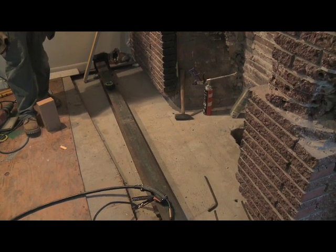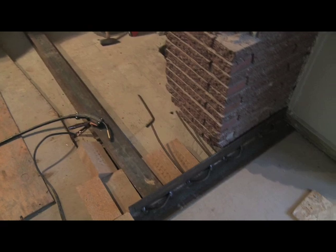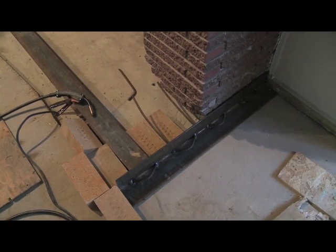And it's important that we have the steel support structure, because we can't have concrete or heavy stone actually bearing on the wood floor elements, because the floor joists weren't designed for that kind of load. And so we're going to reinforce this over the beam. The beam is going to become integral with the slab as a composite beam, and we're going to reinforce the firebox and the floor system to further strengthen this installation.